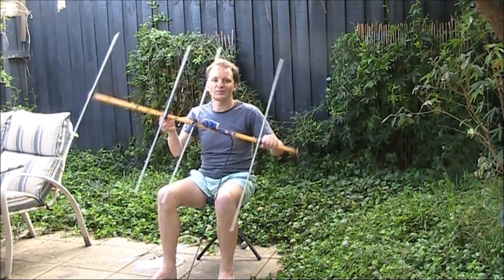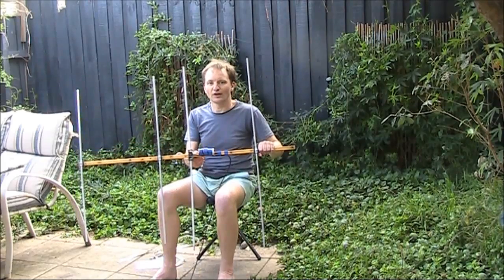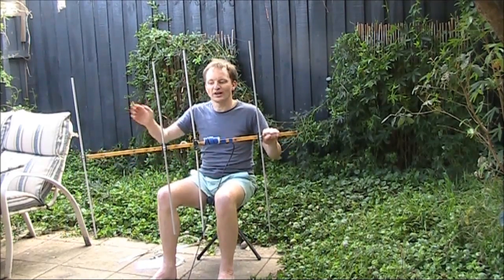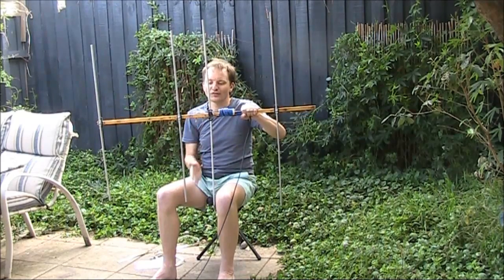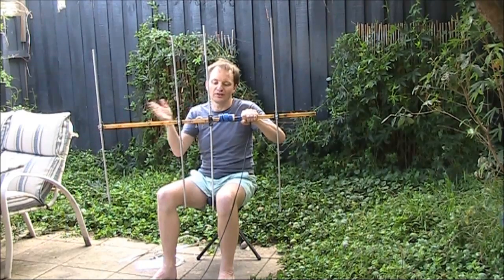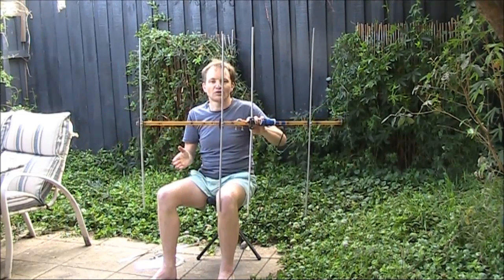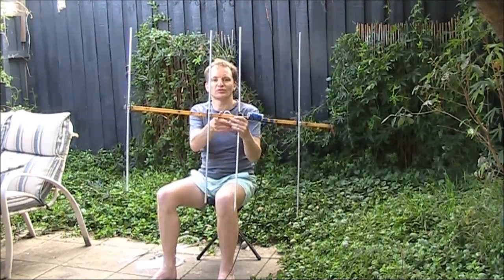Or, if you're looking for a small antenna at home that looks pretty much like an old TV antenna, then something like this on your chimney would be great for two-metres SSB. If you're going to use it on FM, you'd want to shorten the elements a little bit and mount it vertically polarised. A problem with vertical mounting is if the mast is metal right there — that's going to play havoc with the elements, the radiation pattern, the gain, and detune the thing. So either use an insulated material as a vertical mast, or have a metal horizontal standoff to stand the antenna off the main mast.